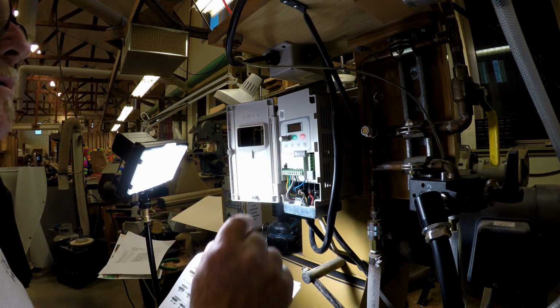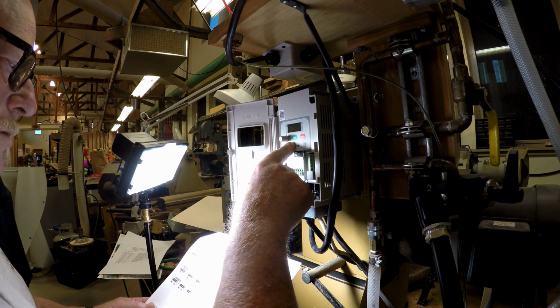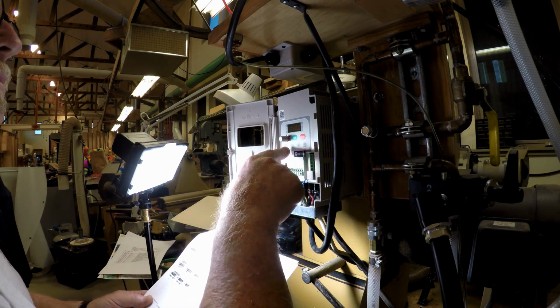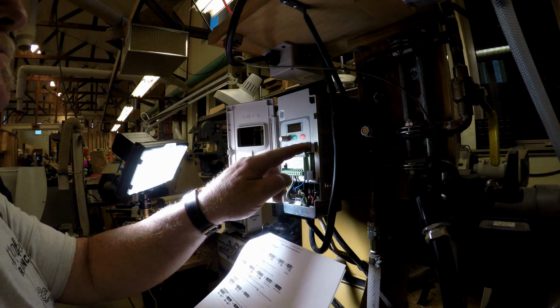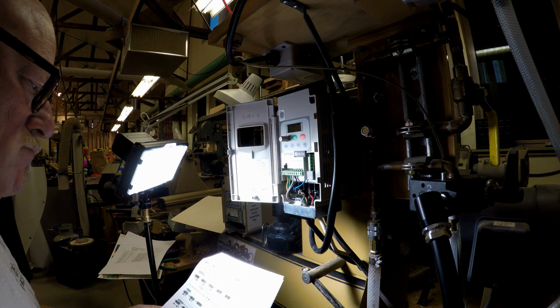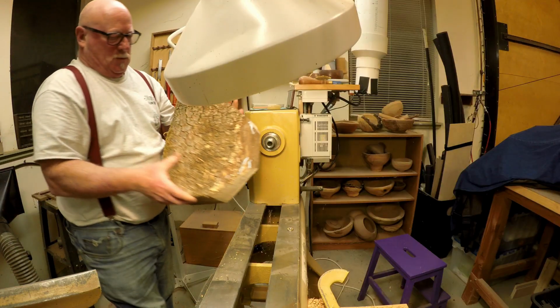Now, with the hardware working, it was time to program in the appropriate parameters. Actually, it sort of works with no changes at all to the stock settings, and it required remarkably few custom settings. I only had to key in 14 of them. Mainly, it was minimum and maximum output frequency and voltage, and settings for motor acceleration and deceleration rates. To my relief, it turned out that the buttonology was nowhere near as difficult as I had feared.